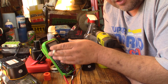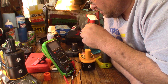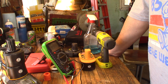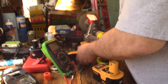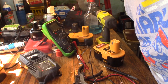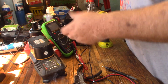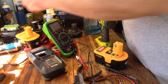What most people do is they leave their batteries on their charger and they grow whiskers. I've gotten two of these batteries charging now and working, so I'm just going to show you what I do. It's dangerous and I don't recommend you do it yourself, but it will blow those whiskers out from between the cathode and anode — or it will blow up in your face. It hasn't happened to me yet. I'll put this battery in the charger to show you — you can see it's just blinking red, it won't take a charge.